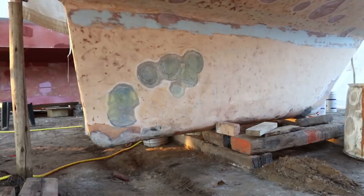All the voids are now filled and I have patches on the access holes. I've removed the very aft blocking. Now I'll start laying in a big heavy layer of fiberglass around the bottom to build up that area and give more protection in case we ever bump the bottom — which we have in the past. It may not be as good as that nice conveyor belt rubber bottom, but it'll certainly be better than what we have now.